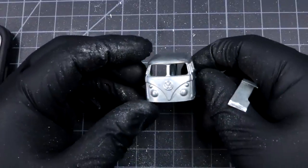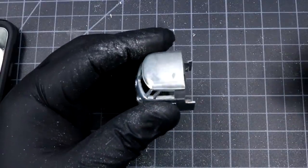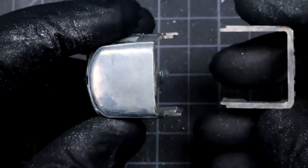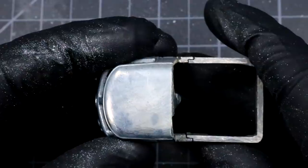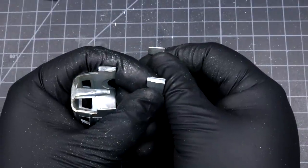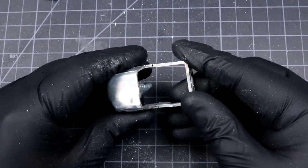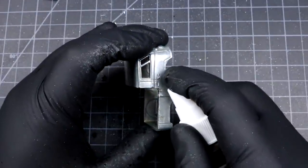All right, so I wanted to try something out. In the bodywork world, nowadays when they're epoxying panels onto cars, they flange them. So you can see here, I've cut flanges on both sides and matching flanges on our box. So now when I glue this together, we have an overlapping joint, and it's going to be crazy strong. Push this out a little bit so it actually has to force itself in there. It almost clicks in. Just going to use a little bit of Insta-Set to kind of get this party going here.